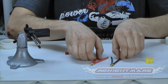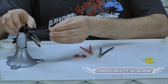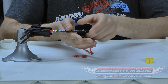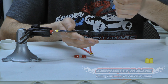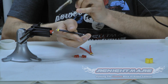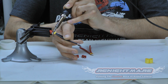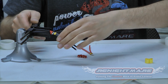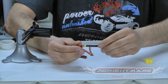So we have our wires prepped. Both ends of these are now going to go to our female Deans. Let's start with the black wire. The whole goal here is I'm going to try to melt the wire right to the Deans in one quick motion — I don't want to keep the heat on there too long. I don't want to put one wire on now and one later because you risk getting a cold joint. Take our tip, give ourselves a little bit of extra solder. There we go — melt it all the way through and let it dry. I have both wires soldered on at the same time so I know I got a good solid joint.